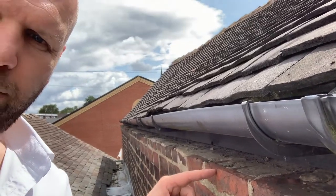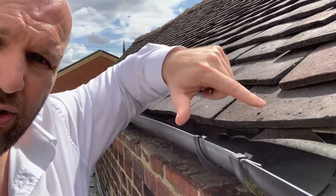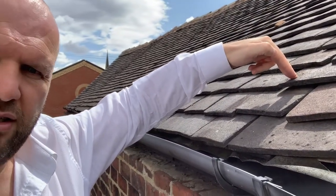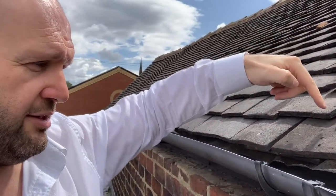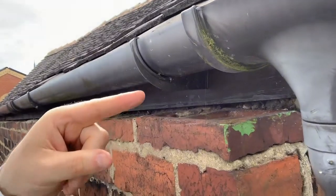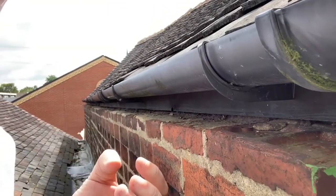What we tend to do is lead over the top of it. If you've got an older membrane — what we call Slater's felt — a common problem is the UV rays attack it and it breaks down, goes to bits. Eventually it rots so far back that any water getting underneath the end of the felt will run back off the tile, won't find its way into the gutter, and will end up on this brickwork. All this ends up flooded and the water soaks through the brickwork, going down onto the inside of the property.